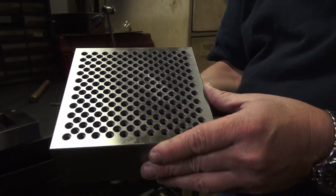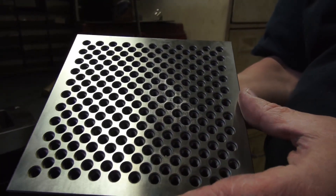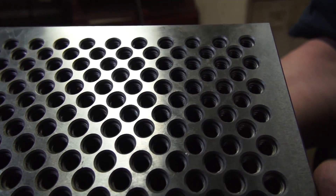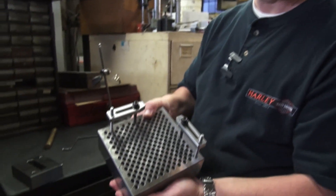So I came up with the idea of utilizing a plate with a grid of tapped holes, where you can use clamps and utilize all those tapped holes for clamping a piece, mounting it to a fixture, and then grinding your block square on two sides — clamped at one fixture. Flip it over and do the same thing on the other side.